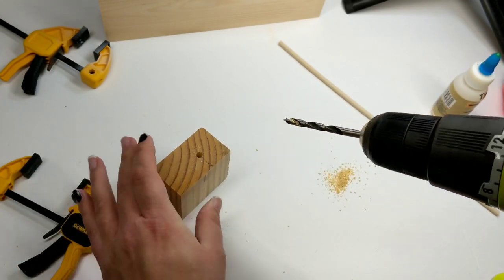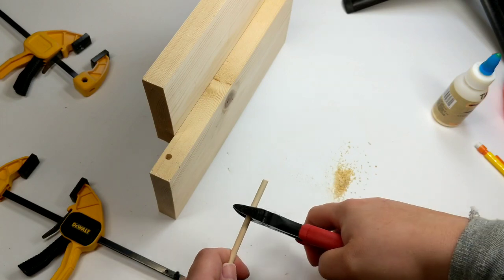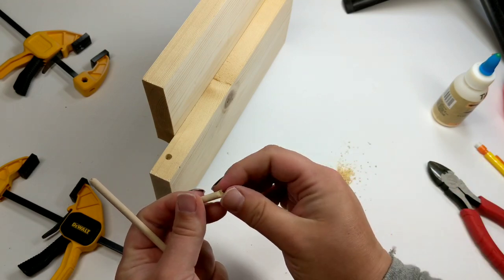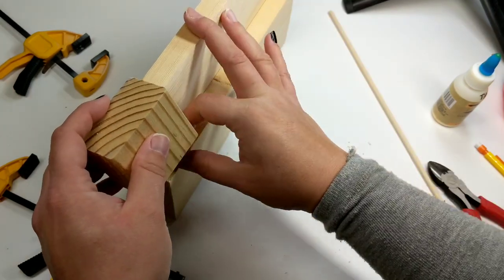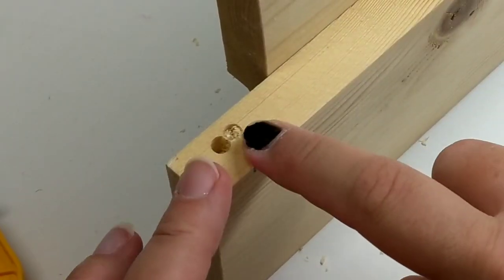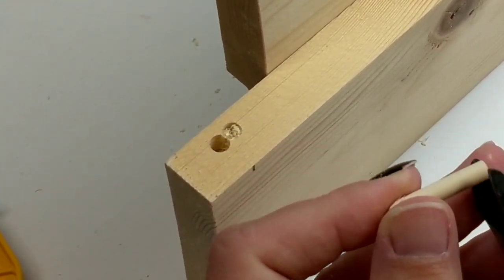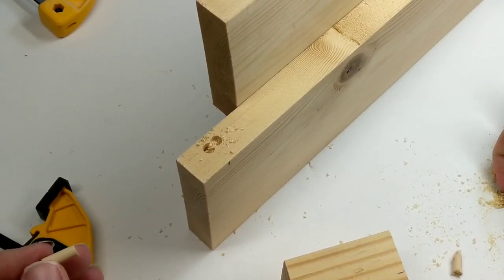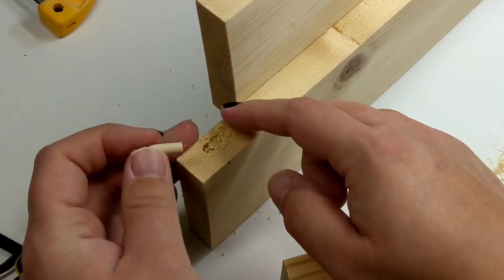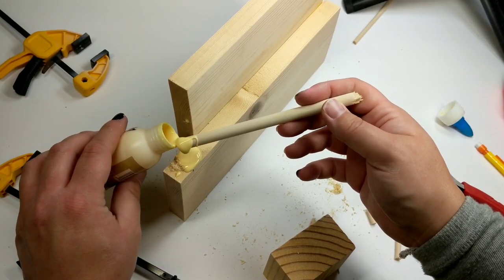I created a hole — make sure it's deep enough, not very shallow — and got all the bits out until done measuring. I like to add some shavings back in. If you put the hole too far over like I did, here's how to fix it: drill another hole right next to it, pack your wood shavings into the unused hole, and when you put your dowel in with wood glue it'll still hold. Don't leave the lid open on your glue though — it dries out.